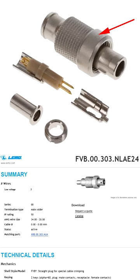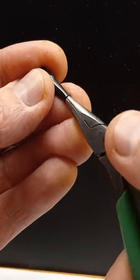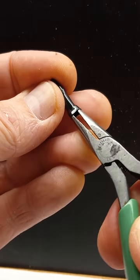Outer shell, slip insert carriers with keyway, internal connector, crimpable collar, and nut. This is a little trick to stretch the strain relief to fit the Mogami or any other microphone cable.